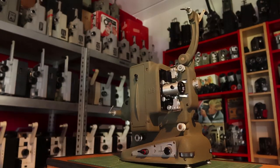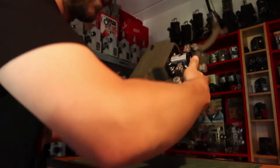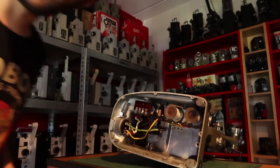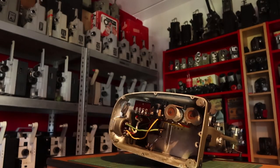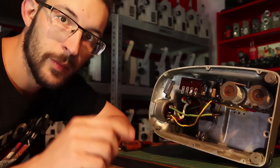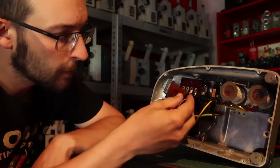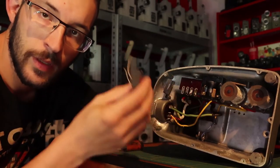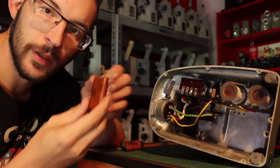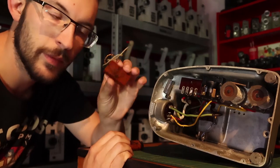Then I'm going to tackle the second problem. Let me just flip it on its side so we can look at its insides. I already had the bottom removed earlier. Inside the projector are these things — capacitors. This one was sitting right here. I cut it out because this is a dangerous part. It's a tar capacitor and it is also made in 1953.